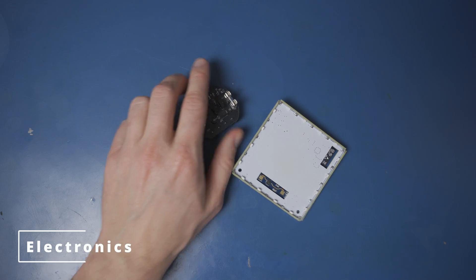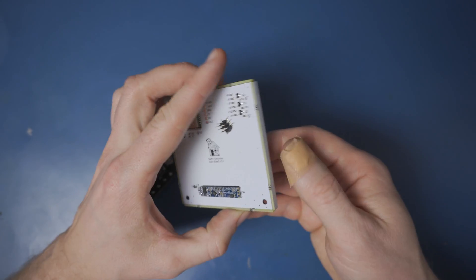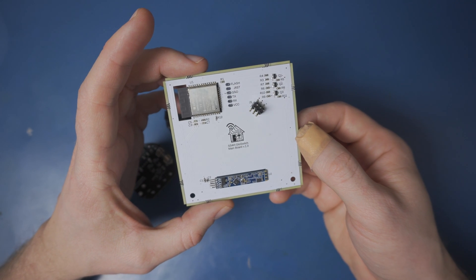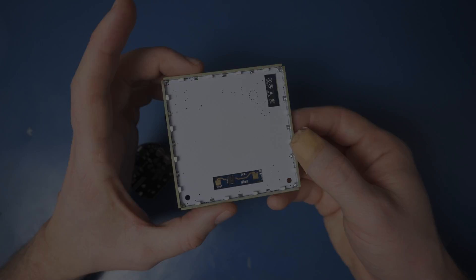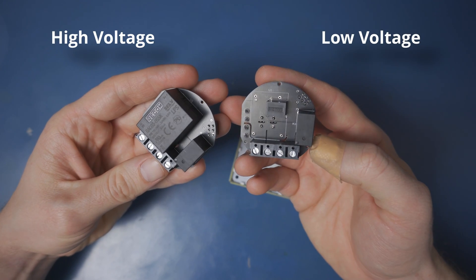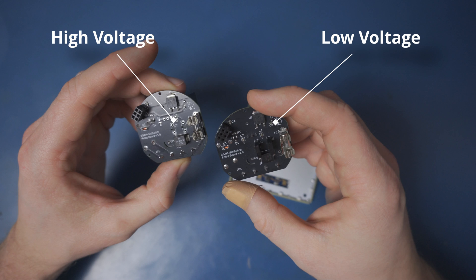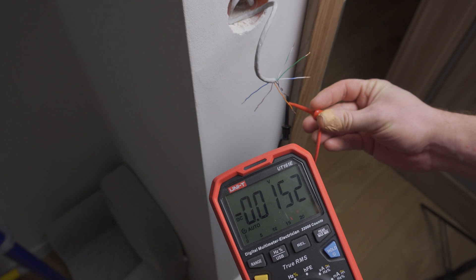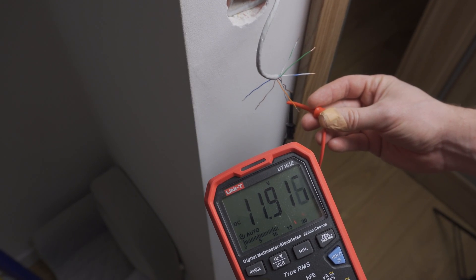I split the device into a low and high voltage side, which should be handled with caution. Side boards with LEDs are attached to the main board that holds the ESP32, the LD2410 microwave module, the touch button, and the rest of the components. The second PCB is the relay board. Depending on the components you solder, you can run it on low voltage from 8 to 28 VDC or straight from mains. In my place most electrical boxes have an Ethernet cable running to a central hub, so I have access to some GPIOs and 12V power. That's why all my glow switches run on low voltage — but I also made a version powered by mains.